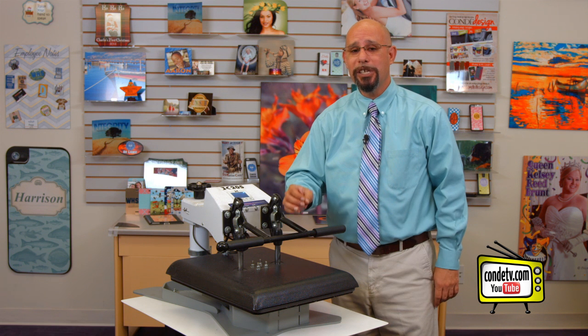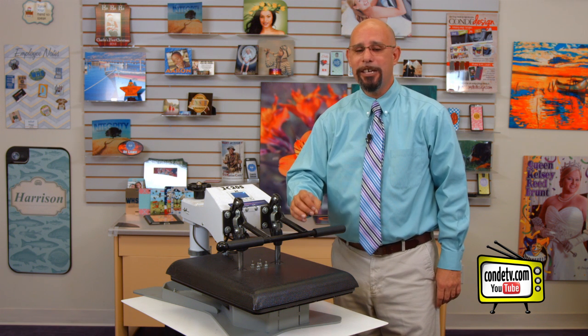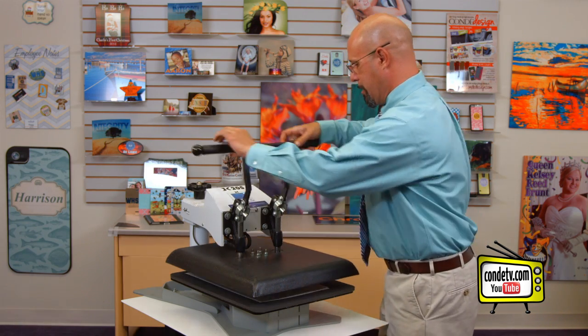Now those of you who might be familiar with the old formulation Neenah ImageClip laser light, my advice to you would be increase your dwell temperature by 10 degrees, increase your pressure by half a revolution turn, and you should be dead on when it comes to weeding the new formulation.